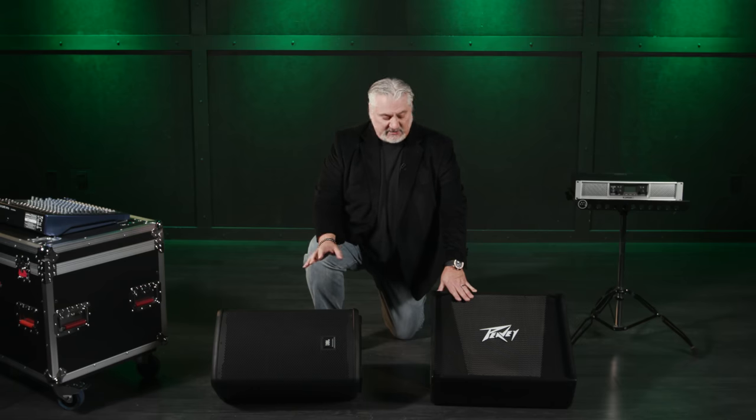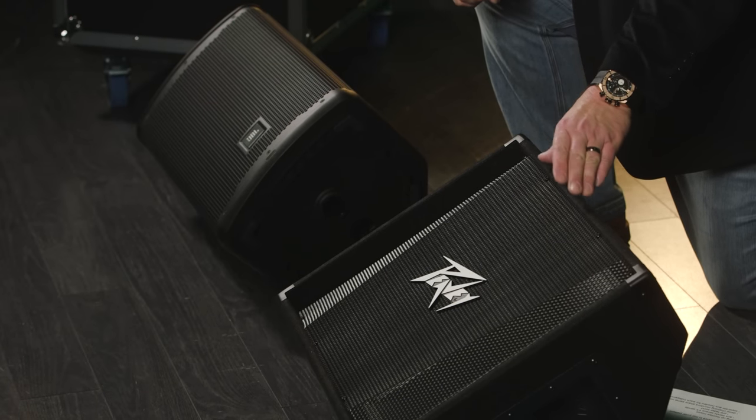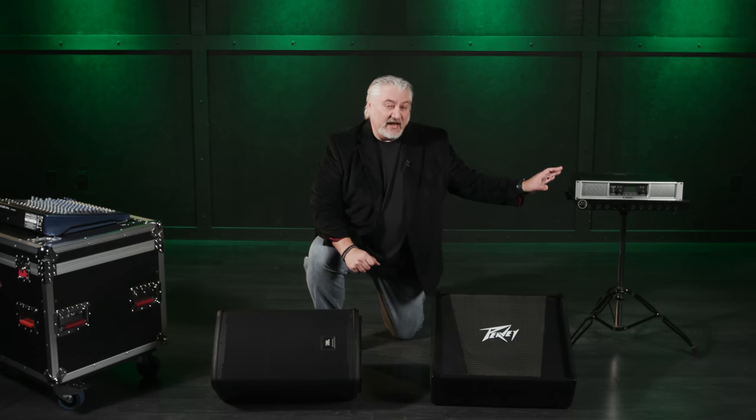There's one other important difference between active and passive stage monitors. Many times you'll be daisy-chaining them — connecting them as a series of speakers. With active monitors, this is very simple: you just use basically a microphone cable to connect one to the other. With a passive monitor, every time you hook up an additional speaker, you change the overall impedance of the system. A single PV monitor like this is 8 ohms. Two connected together would be 4 ohms, three would be 2⅔ ohms, and four would drop us down to 2 ohms. This is important because the amplifier needs to see a certain impedance to perform at its best and prevent damage.